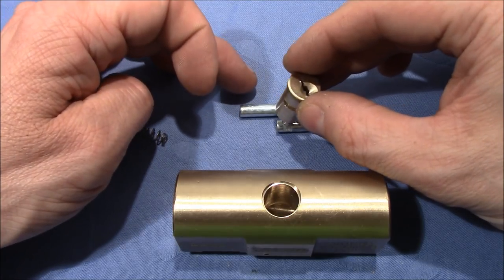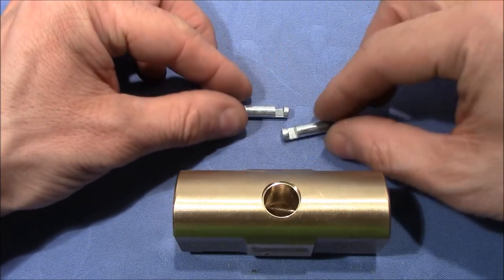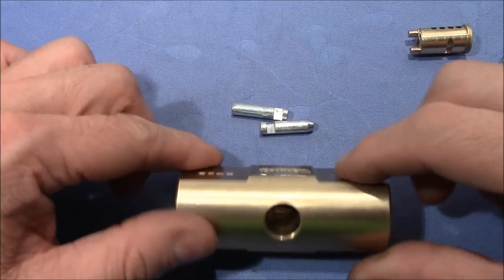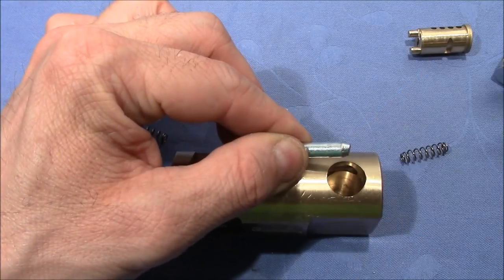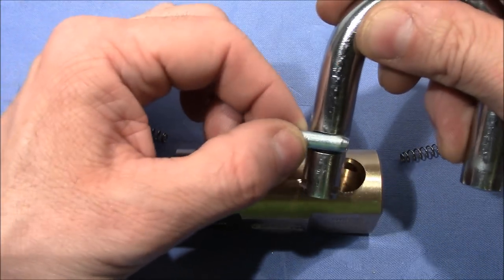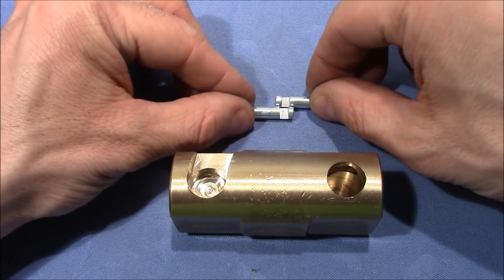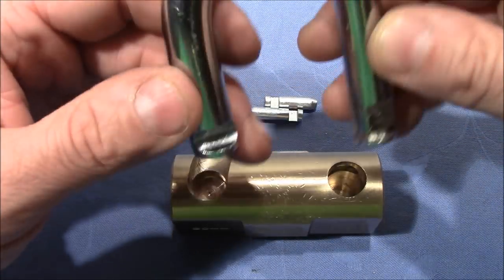And you can imagine when you turn the plug left and right how you can cause these locking bolts to be pushed out or pulled in. And that's the way the lock is opened or closed. When the bolts are in this position, they are in these grooves, and so the shackle cannot be pulled out. And when the lock is in the open state, they are pulled together so that they make the room free for the shackle